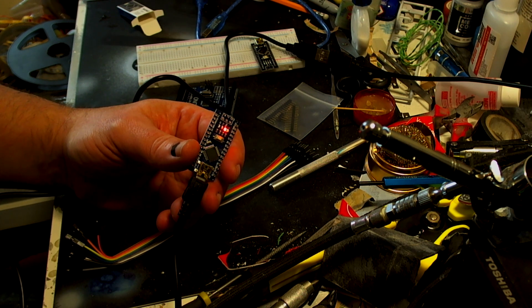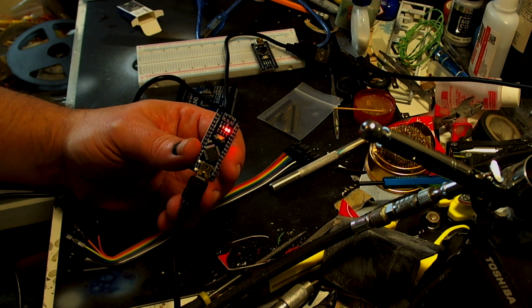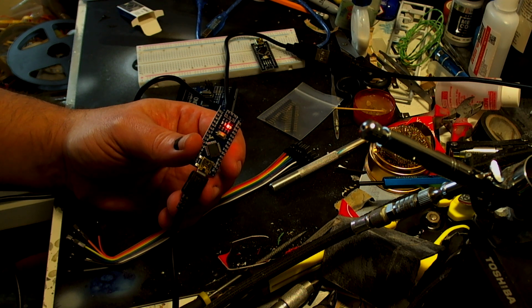So I'm just going to quickly close the Arduino, open it back up again. Do the same that I just did a minute ago. Right, verify that code, make sure it's fine, and that's fine, and go to Tools, Arduino Nano, old bootloader, and it's on COM8. That's why, let's change.